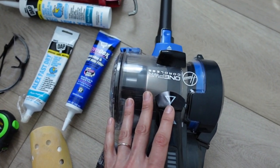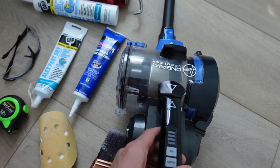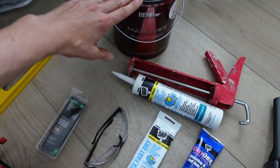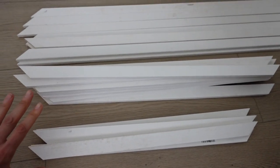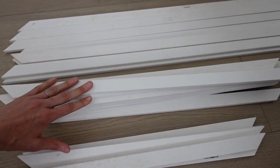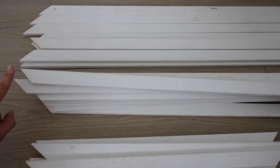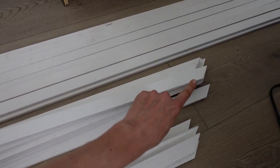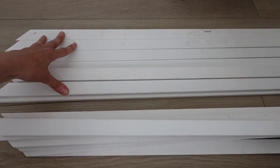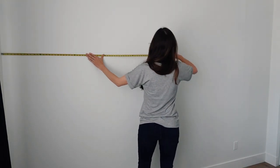I'm going to be using my Hoover One Power Cordless Blade Vacuum - I want to thank them for sponsoring today's video. I'm also using a paintbrush, a roller, and of course paint. Most importantly, your trim boards - I have three different sizes: small at 22 inch, medium at 24 inch, and then 63 inch. All the boards are cut the exact same way so the outer corner is outward on both sides. I have four small boards, 10 medium boards, and eight extra long boards.